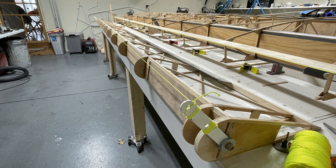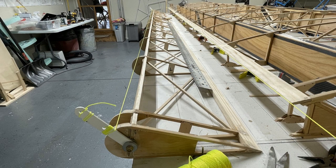It's my money and my project, so I'm just obsessed with getting this right. I'm using the actual aileron hinge to look at the circumference and make sure everything is really super straight — a little OCD is kicking in. I mounted a string from one hinge all the way down to the other, and I can set them at the exact same degrees around that radius. It really showed me how far off I was on some of these ribs.